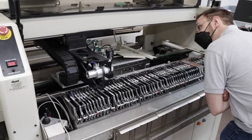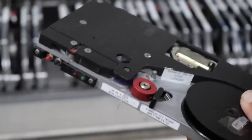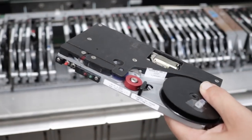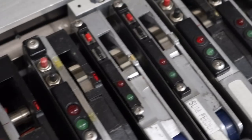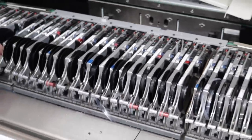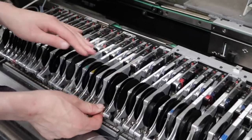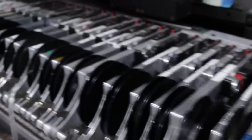Tanner has an entire other pick and place machine which we took a really good look at, especially the feeders. They are smart feeders that can talk back to the pick and place controller, but they also have a break beam mode — a little sensor over the pick area detects when the nozzle comes down and picks the part, then automatically advances to the next part. You don't need to communicate with the controller at all; a little optical break beam sensor sees the pick and advances. No communication needed — it just does it automatically. Pretty cool.